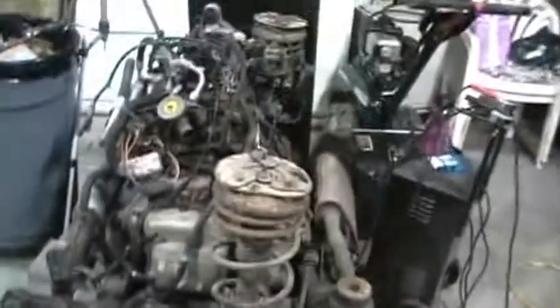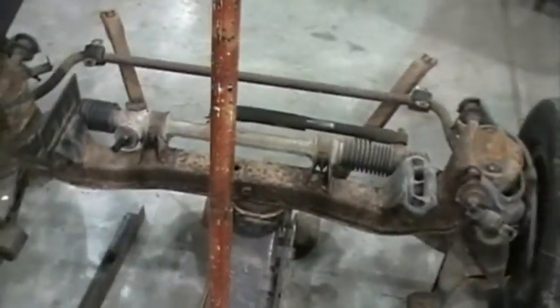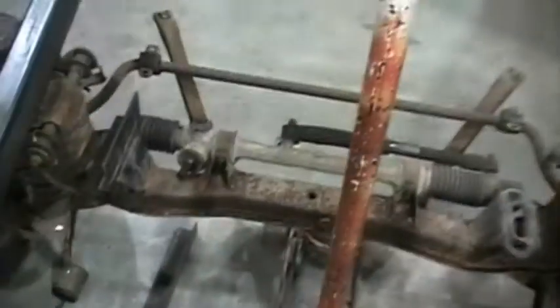I got my suspension assembly out here and the rear end with the motor over here, but we start from the steering end and then work our way back. You can always push it in the wrong direction but you ain't going to steer it in the wrong direction, so we make all our precision measurements off the front while we put the front end in, and then as long as we get that front end nice and precise, everything will fall into place in the back.